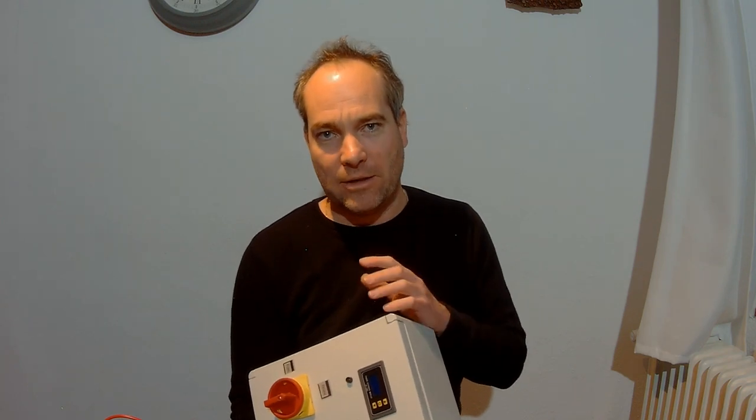When the turbine is producing over voltage, or reaching the maximum output of the controller, or the maximum input for the battery, the charge controller starts to brake. If you reach the maximum output voltage, the charge controller automatically short circuits all three lines of the turbine and brakes it down immediately. There's also a manual brake switch to brake the turbine in case of an upcoming storm or hurricane. When you brake a running system there is a lot of energy in the system, even if only for a very short time.